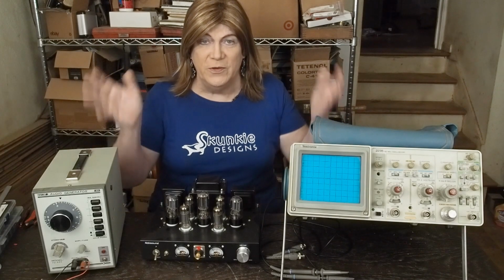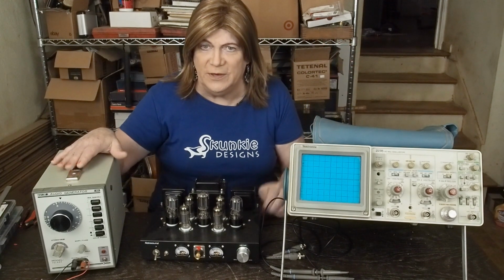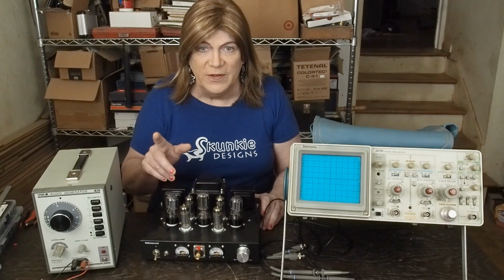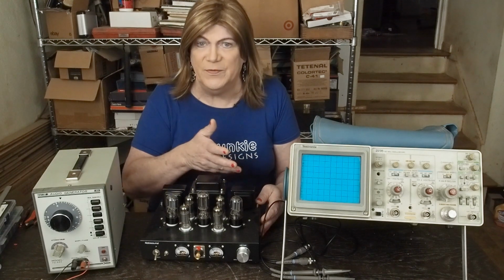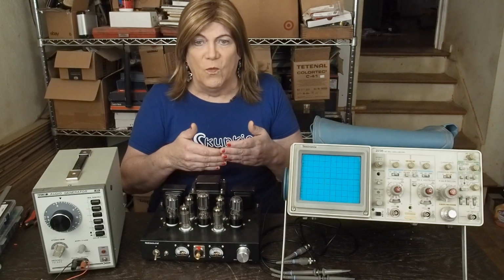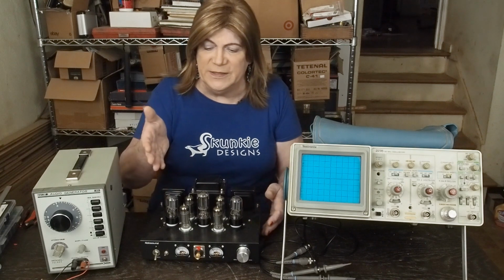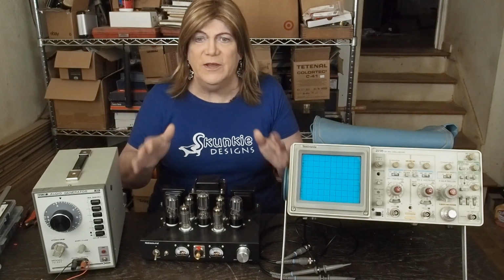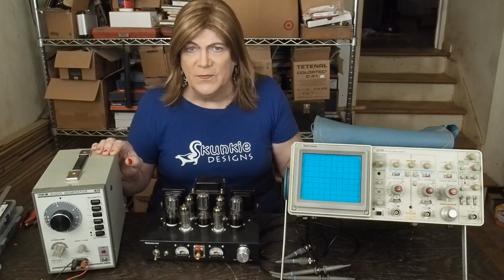Let's wrap this up. Well, I hope you all have enjoyed this video showing you how to use the basics of an oscilloscope and a signal generator with a tube amplifier, how to connect things up, how to be safe. And this is one of the best ways, if you've got just a dead amplifier, of figuring out what's dead. Is the coupling cap open? Is the output tube dead? Is the driver tube dead? Is there something wrong with the potentiometer? You can figure out all of that stuff using a signal generator and a scope.